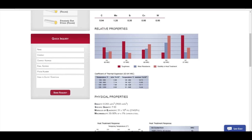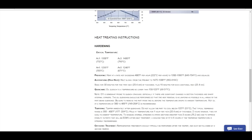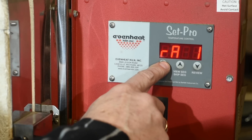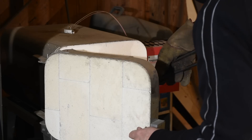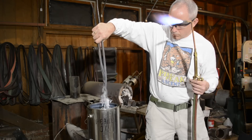If you want to know more about these steels, Google is your friend. If you Google 'O1 technical data sheet' or 'S7 technical data sheet' or whatever it is, the manufacturer will tell you in a technical data sheet all about the composition of the steel, recommended heat treatment, and all kinds of useful information. To make a really general statement: if you see chromium in a steel, you probably want some kind of professional heat treating equipment. On the other hand, anything that says water hardening or oil hardening is something you can heat treat reasonably effectively with simple equipment — sometimes just a blowtorch and a bucket of oil. All things being equal, if you don't have a lot of experience and fancy equipment, you can't lose by starting with O1 steel.